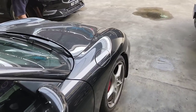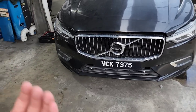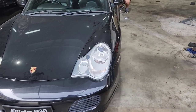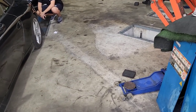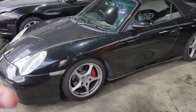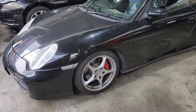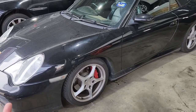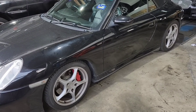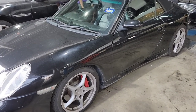And when they have a new design, they will go through the load testing, simulated load testing, to study whether it can handle the load or not. If it passes it, then they will produce the wheel, because every single wheel is milled from a single solid block of aluminium. So that's how they created the wheels. So you can have any design as long as it passed the load and the machine is able to basically mill it. Milling is like the reverse of 3D printing, right? So from a solid block, they cut it down.